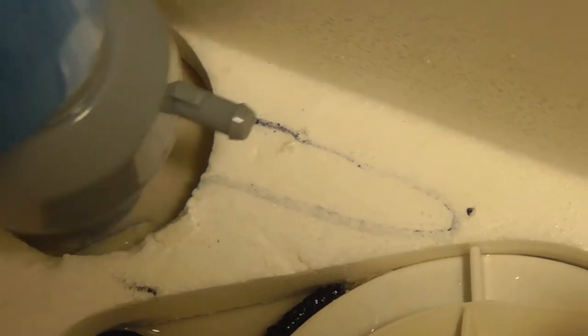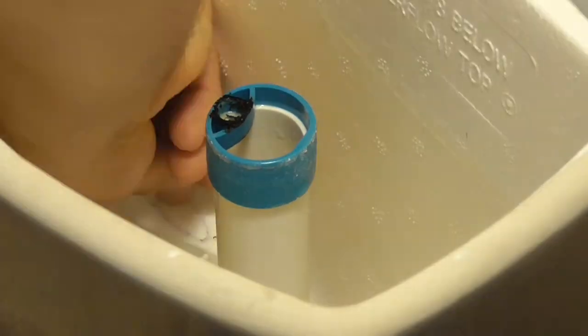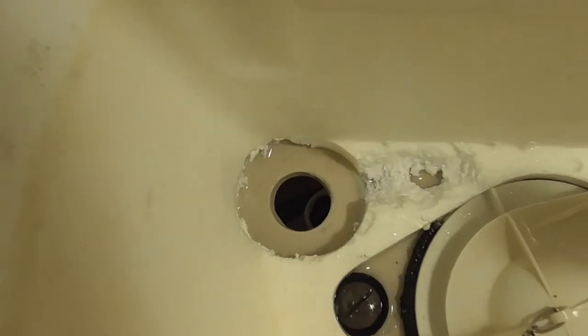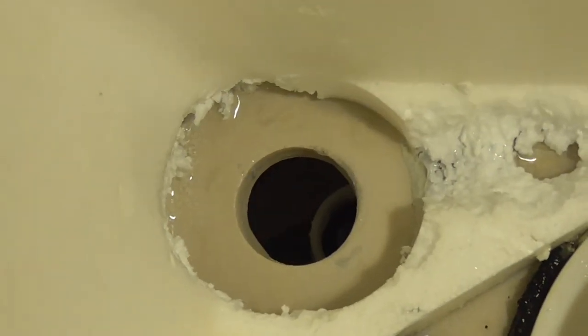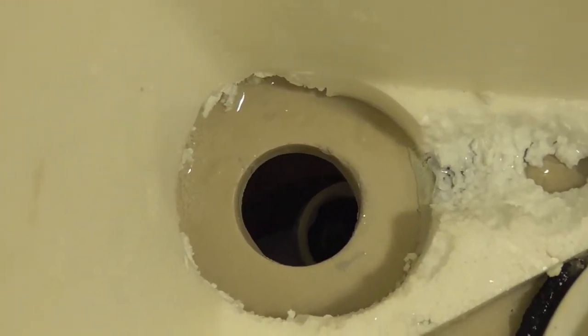This appears to be a problem with the manufacturing process of this toilet. If you run into this, the following steps worked for me. For the discharge port, I simply marked off the area needed to accommodate the tube with a marker. Then, I carefully broke apart the foam with my fingertips, like this, to accommodate the port and tube. And for the off-center hole problem, I took a flathead screwdriver and quite easily, carefully with the tip, sliced away the foam and putty that held the foam to form a round accommodating hole for the valve.